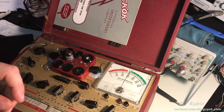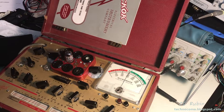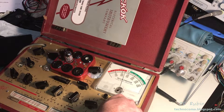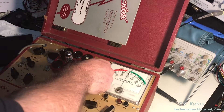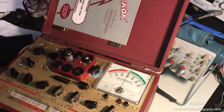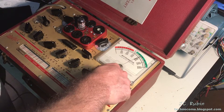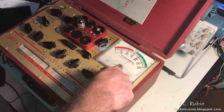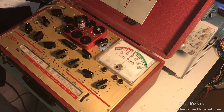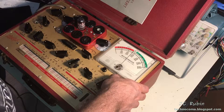I'm not entirely sure this is correct, but if a tube perfectly matched the expected mutual conductance reading — as this tube managed to do at 1250 — then shunting it as specified at 58 and landing on the money would show us where the test set places the needle for a really good tube on a pass/fail scale. We can see it takes us around the 2000 mark, so that answers the question of where 100% pass/fail sits relative to the expected transconductance value.